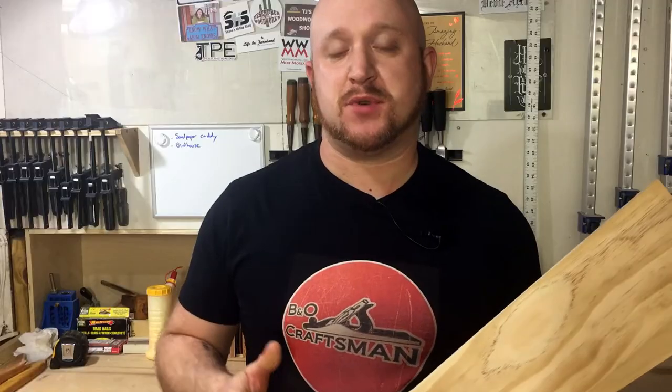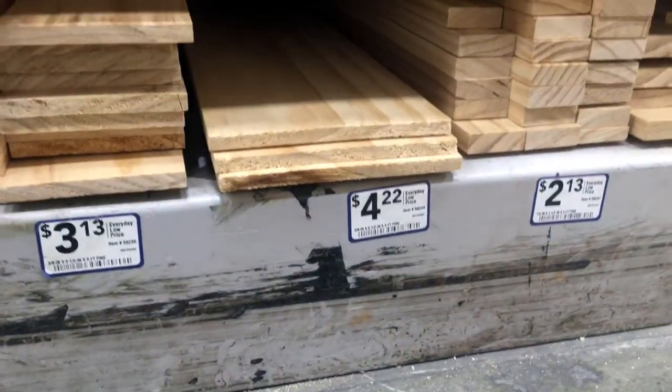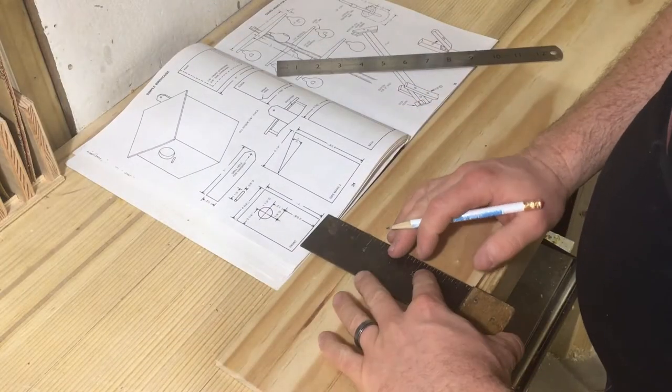So let's go ahead and get started. For this project, you're going to need two boards from your hardware store. When you look for these boards, make sure you find three-eighths of an inch thick. I went ahead and grabbed two that are 36 inches long and six inches wide — they're actually five and a half. I've made some adjustments on the plan so the measurements match what we're actually building. The first step is to go to my website, find the link in the description of this video, download the plans for this birdhouse, and then cut out every board according to the plan.